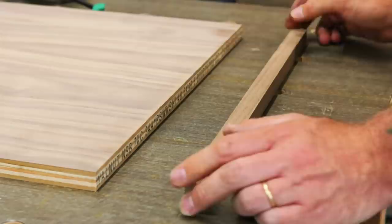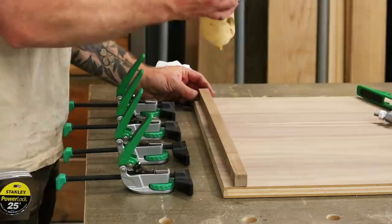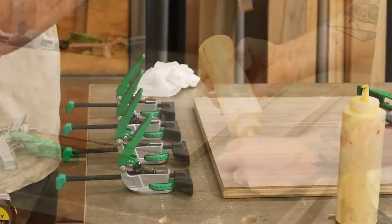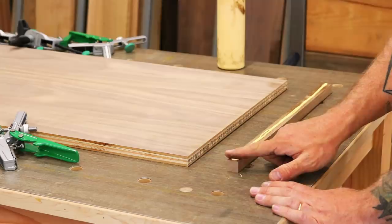Here's a little piece of friendly advice: our plywood is three-quarters of an inch thick. Please do not cut your facing three-quarters of an inch thick — somewhere during this process you will go below your veneer and burn through it trying to make it flush. You want to cut your facing about a sixteenth of an inch too big, then go back with a trim router and make it perfect when you're done. Your goal is to get a nice smooth transition.